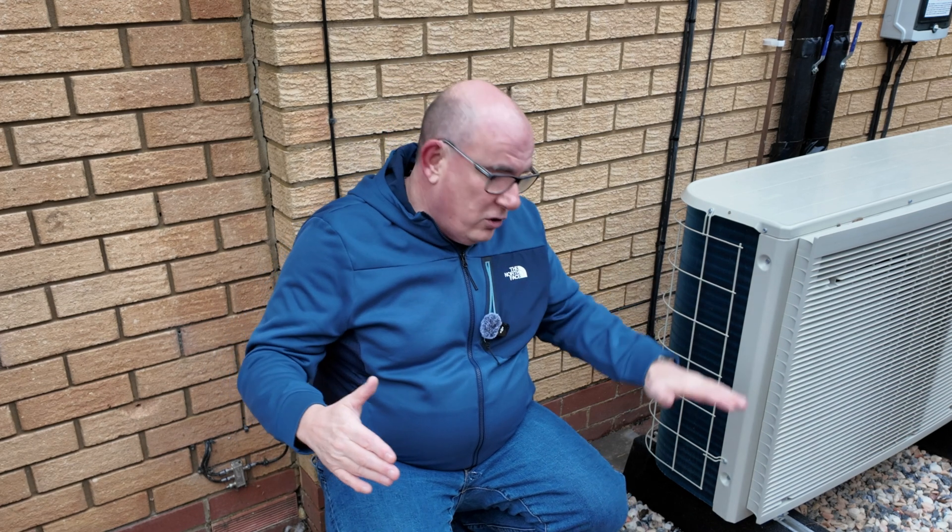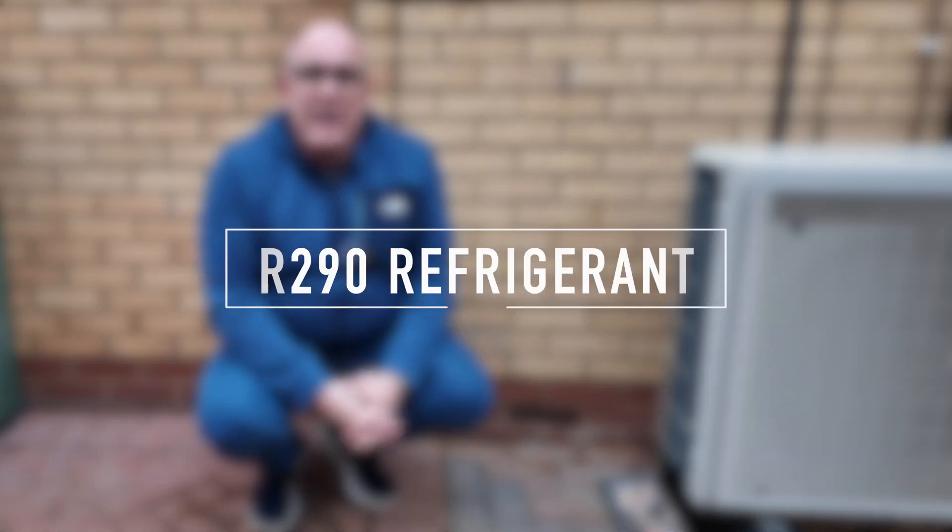On the coldest days the soak-away might not be enough — last week we had frozen water on the ground around the unit because it couldn't drain away fast enough. If you're planning to put the heat pump near a doorway where people are coming in and out, be conscious of the radiator on the side closest to the door. There could be a pool of ice building up around the heat pump.